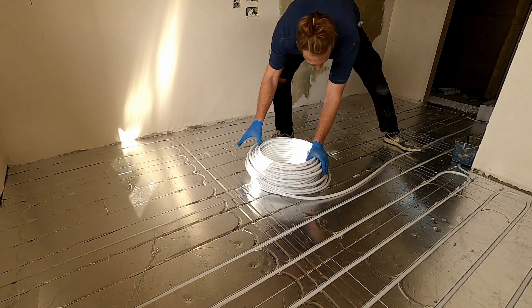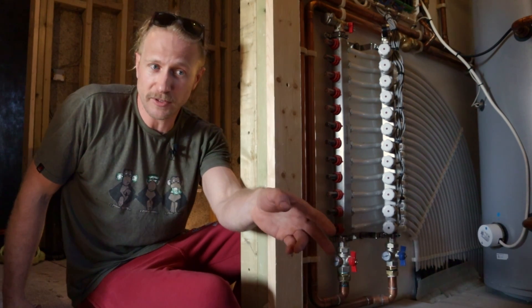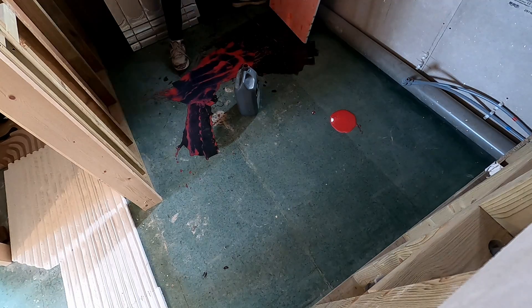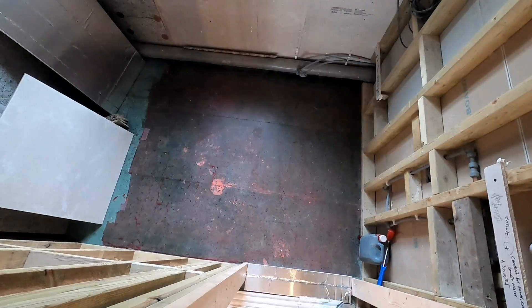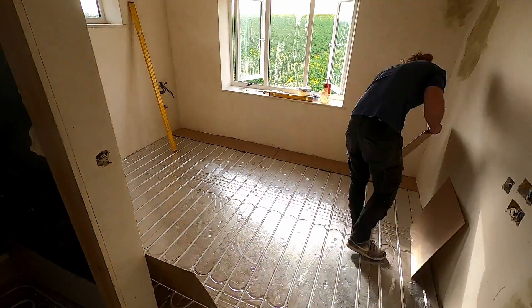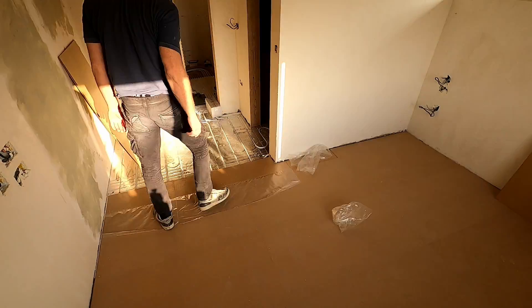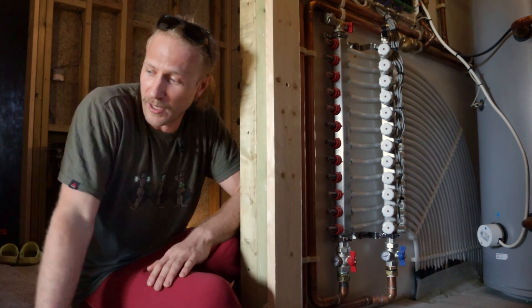In the bathrooms we didn't loose-lay the overlay boards because we're tiling onto them — we needed to glue and screw them down. I prepared the floor, cleared the dust, primed it, sprayed adhesive onto both the boards and the floor, and stuck them down — you had to get them right first time because they stick immediately on contact. We then screwed them down with washers. I've tiled the ensuite already and nothing's moved. In the bedroom, being the only carpeted room, the underfloor heating company provided two layers of 3mm cross-bonded MDF overlay board to give a decent base for carpet.